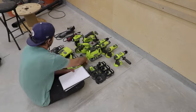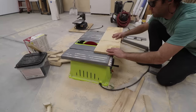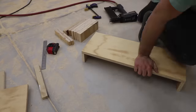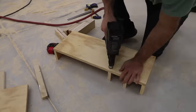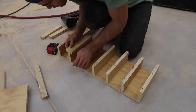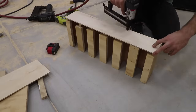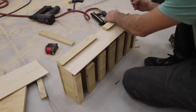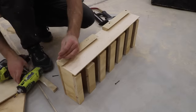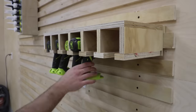I'm going to make my own holders for tools. I have a bunch of leftover pieces of half-inch plywood from the walls, as well as some three-quarter inch wood from the two-player pinball machine, so I'm first going to utilize that wood. I started lining up tools and making plans for everything I have. In most of the holders, I left a bit of extra space for new or additional tools, so I don't have to remake an entire holder when I acquire something new. It's mostly all just boxes that are nailed and glued together with a cleat on the back, with a few little tricks to make it custom.